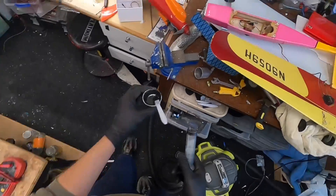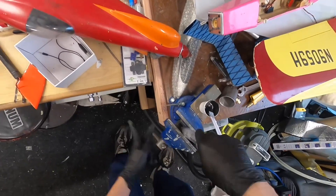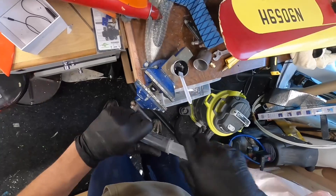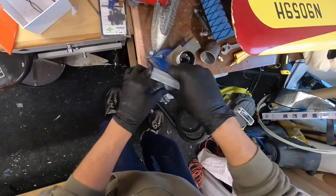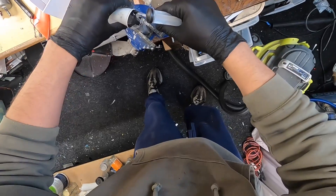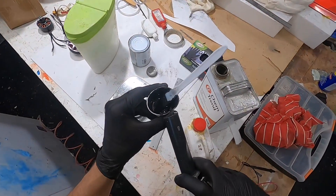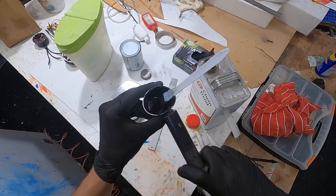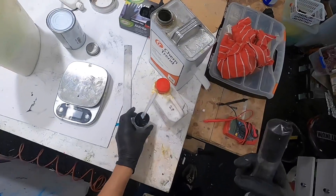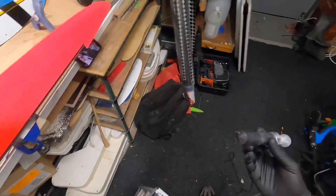Next I want to transfer it into my syringe. I always stand up my syringe in a vice — I find that works best. Pull the air out of the syringe first, hold it in place, then pour the mixture in. For better control, remove any compressible air until it starts going back out again. Syringe purged. Now we can apply our product.